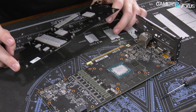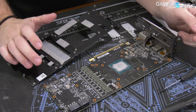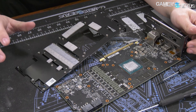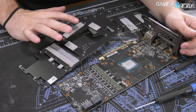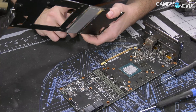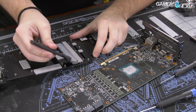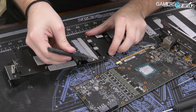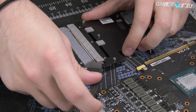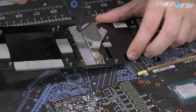The board looks awfully familiar — pretty similar to a 2080 FE PCB. That makes sense because it's an XC Ultra cooler that's on the 2080 and Ti series as well. Thermal pads are everywhere as EVGA tends to do. The big thing here on their base plate is they're now doing a heat pipe under here, which we can reveal with a spudger. The thermal pad connects to the MOSFETs and some capacitors adjacent to the MOSFETs, and you'll see a nickel-plated copper heat pipe.